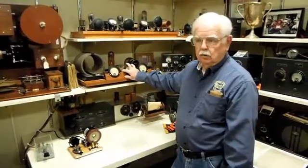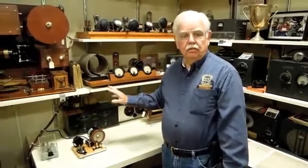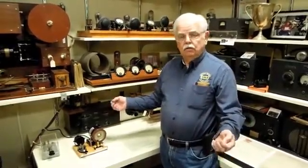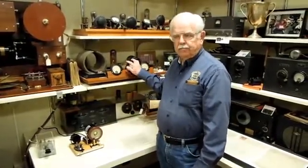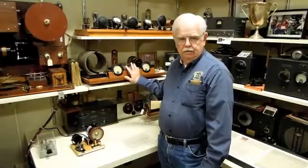This was just here so that you can see that back in 1921-22, an awful lot of people with receivers would have had crystal sets with no BFO and no way to clearly hear a tone. So this was an interim mechanical solution to provide the tone so that almost anyone could copy the CW from one of these transmitters.